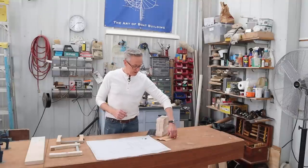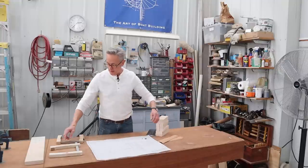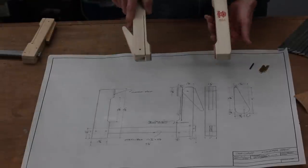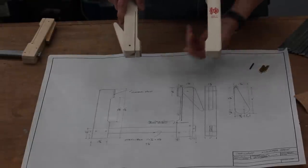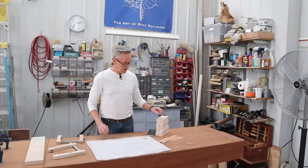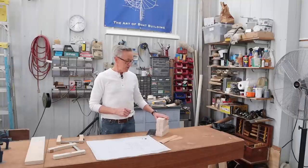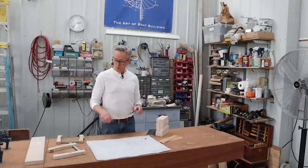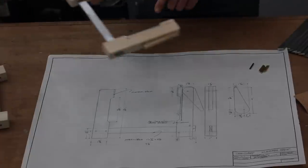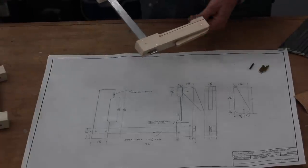The other thing we would need is some cork. So I bought some sheets of cork, and I can see here in the Klemmsia clamp, they are used on the jaws here to protect the material that you're clamping against. So the next step now will be to mill these down so that we can taper them in, as I did here, so that when you're clamping it, the jaw will grab a hold of it.